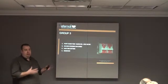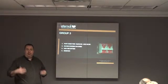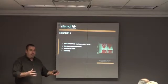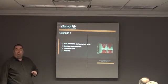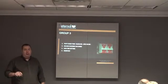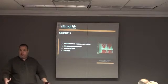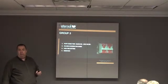We changed that because in the southern part of the country, a lot of these are in attics above people's bedrooms, and the fans were noisy. So they went to the 90-second post-purge at lower RPM to take care of that. Number 2 is only for our 145 machines. Anything with a G12 on the serial number, the new machines, the 145s, when we put the new V6 heat exchanger in there, we had to change the fan speed a little bit. So number 2 will be on, but only on the 145 machine.